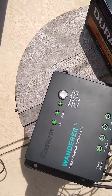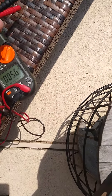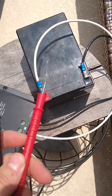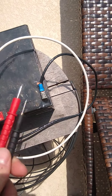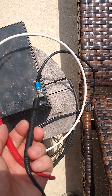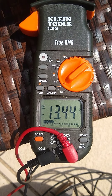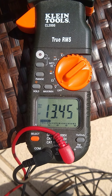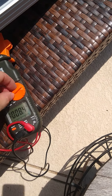Let's see what kind of numbers we get from this one panel. First of all, let's check our voltage — this was at 12.33 earlier. Let's touch the right leads so we don't get negatives and scare people. You can see we're at 13.44 volts, which means that we are shoving some charge into that battery.